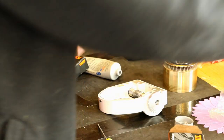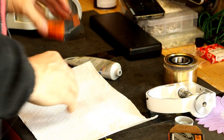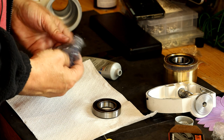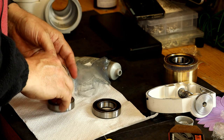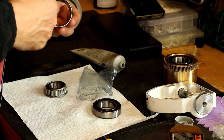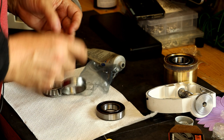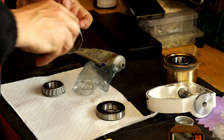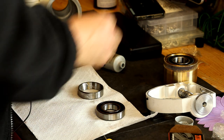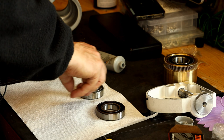Okay, the last two bearings we need to look at. We've got the roller bearing and the final shaft bearing here, and we have the Timken roller bearing. I'm going to put some grease on this one and on the outside as well. Then we're going to load up the bearing, make sure it's got some nice grease in it, and that sits in there lovely.